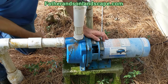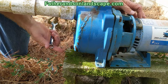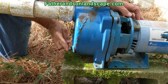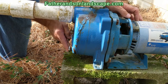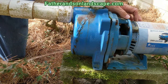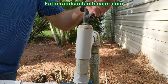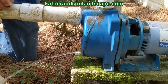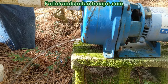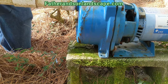It's always best to drain it in the fall at the beginning of winter. To drain the pump, go down to the bottom of the cavity that holds the water — there's a plug here. These plugs take a nine-sixteenths inch wrench to undo. I'm going to unscrew this plug, and then all the water will come out. I'll also open the spigot at the top of the pump to allow air in, which helps the water drain out quickly.